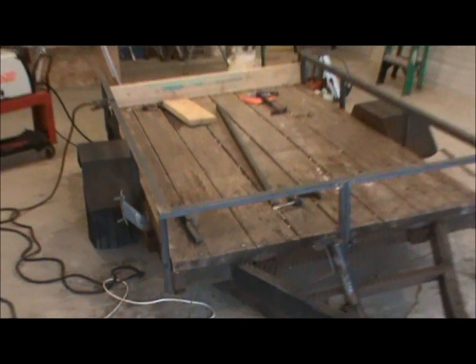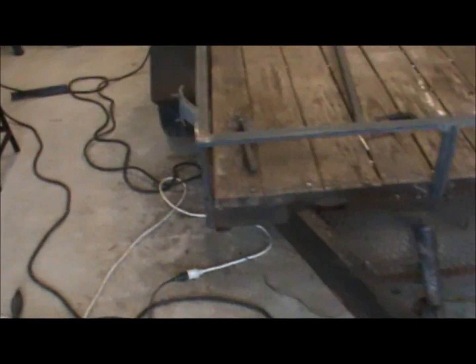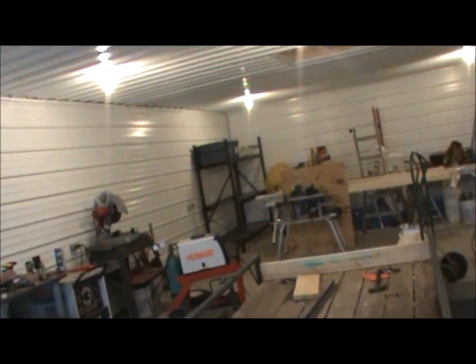Alright guys, I'm just about done with this trailer project. I went ahead and ended up stick welding most of it. I wasn't super stoked about the results I was getting — I think it's mostly just because that metal is still a little rough and the channel I was welding to is a little thicker, so it's hard to get the heat right. I mean, I'm not trying to make up excuses, but all these things kind of play into how your weld turns out. I went ahead and put the channel on the back. They'll hold, no doubt, but they're not as pretty as I'd like to see them. Here's the channel I put on — as you can see I just kind of slid a board in there to see how it's going to work out. But for the most part I think I'm going to call that a wrap, get my shop cleaned up, and thanks for watching guys.